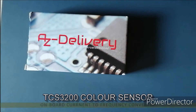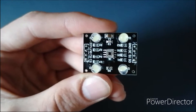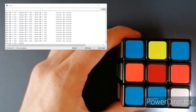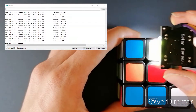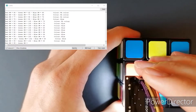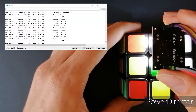I started by just buying stuff and testing it, playing around with it to see if it would work on the cube. The first thing I bought was a colour sensor. It has LEDs to light up the colours and 64 photodiodes in red, green and blue. Calibrating this sensor was really tricky because I found that very small differences in ambient light changed the frequencies enough that they didn't lie in the range of frequencies I'd set. So for now, I decided to not include it in the design and use buttons instead.